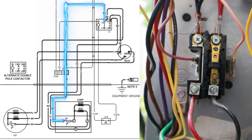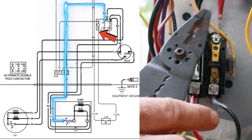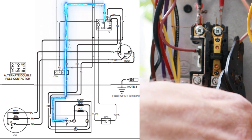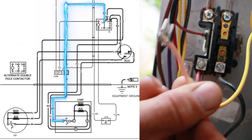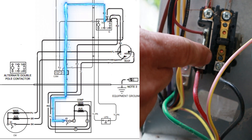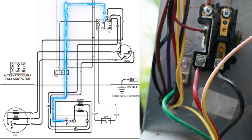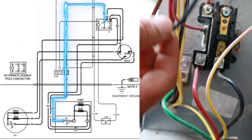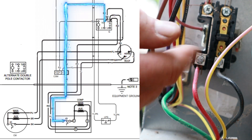I'm going to turn the power off — disconnect is off — and pull the pink and yellow wire that activates the contactor off the terminal. I've disconnected that 24-volt signal from the contactor. I'm also going to pull the black wire off the compressor inside to show that I should be reading 120 volts going right up into the compressor even though this unit is off.